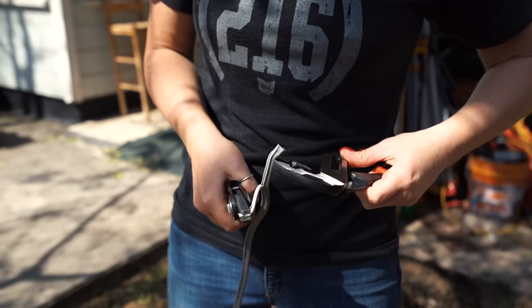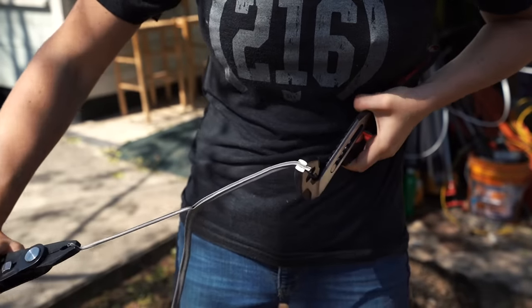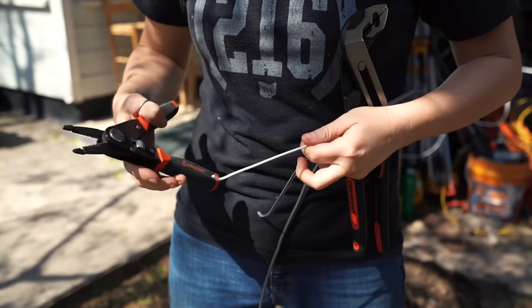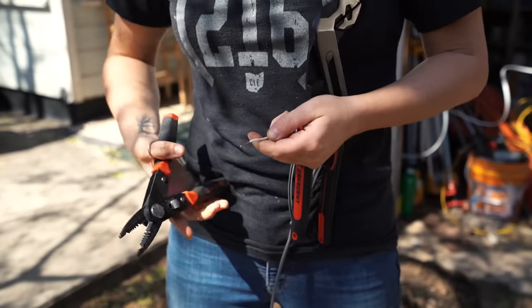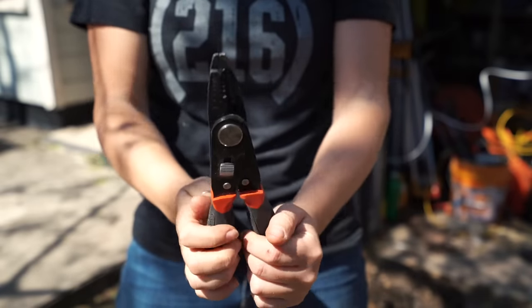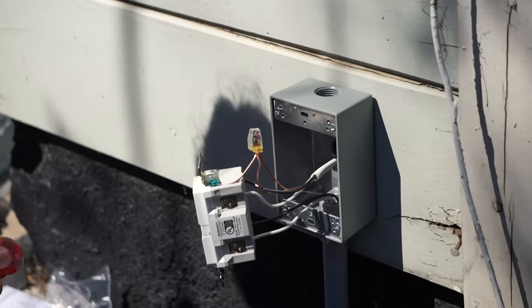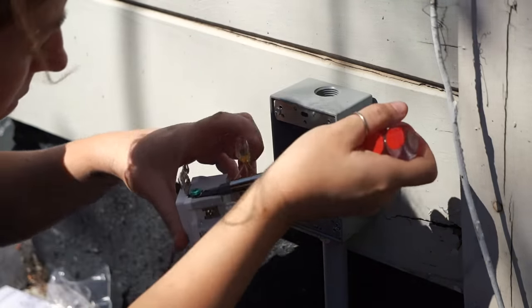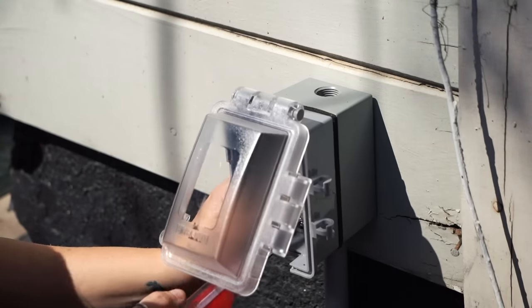It's worth mentioning that direct-bury wire is different than Romex that you run through conduit — it's labeled UFB. Instead of stripping it like normal Romex you have to pull it apart: grab the two wires inside with two sets of pliers then pull them away, which will tear the wiring out of the casing. I recommend these two-in-one pliers made by Crescent — pliers and wire strippers in one — so I could start with the pliers then flip to strippers easily and strip back each end of the wire. Power coming in goes to the line side; power going out is wired to the load side.